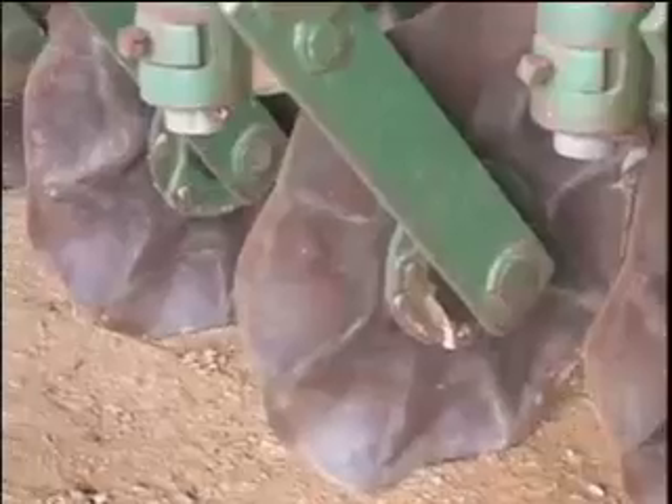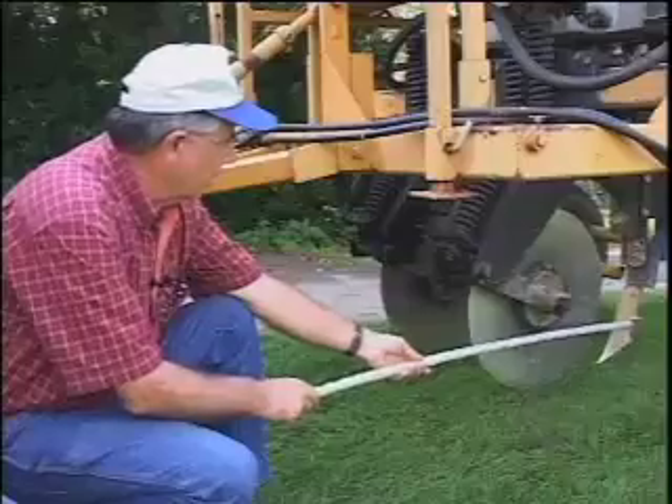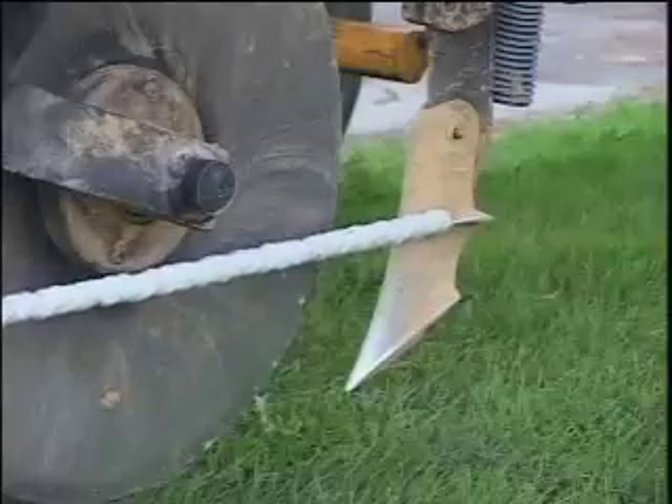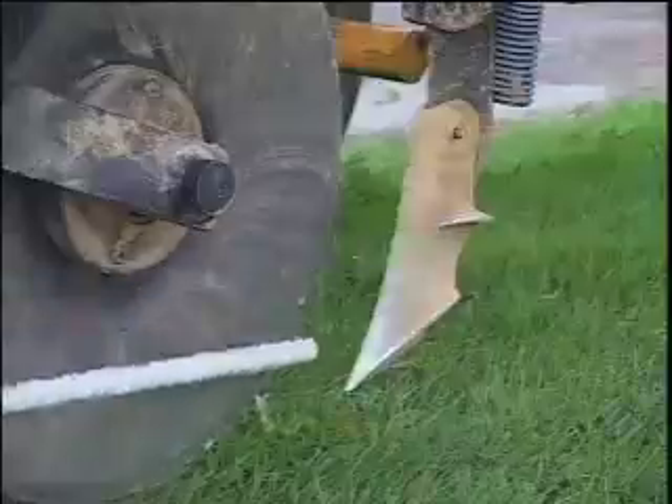And sometimes, to give better soil loosening capacity, we can put a wavy coulter back there as well — that's what you see right here. This is a fertilizer knife that's used to loosen the soil. This particular one has a wing on each side, about an inch wide, and as it works through the soil, it loosens it. In a heavy, compacted, or rocky soil, this soil loosening device is absolutely essential.